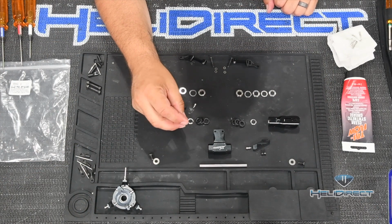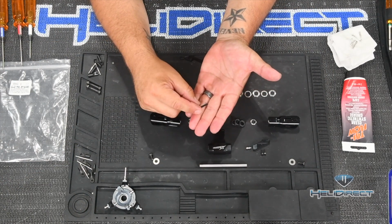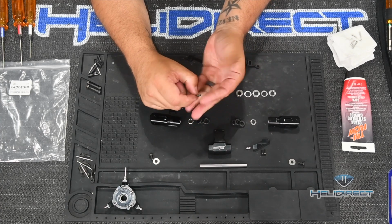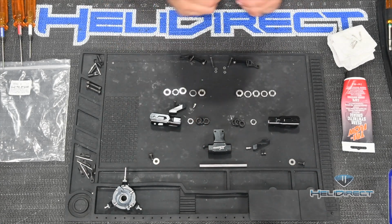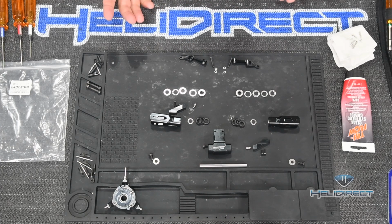Every single bolt in a helicopter, and I'm going to cut to the overhead camera here, as it's machined and created and cut to size in the factory, has a machining oil on the threads of the bolt that is just left over from the manufacturing process. That makes the thread lockers we use, and we'll talk about those in a minute, less effective.